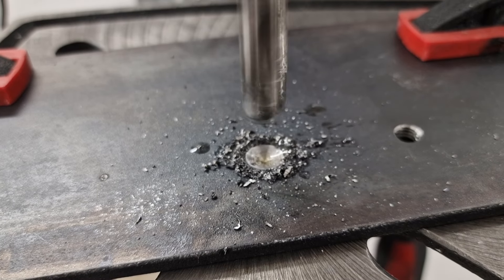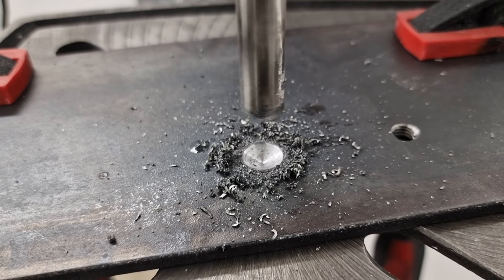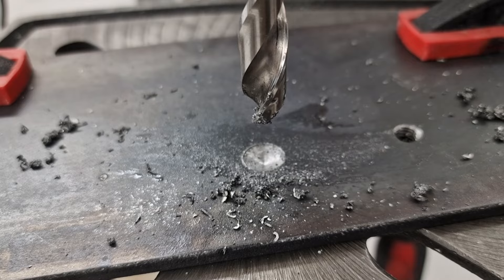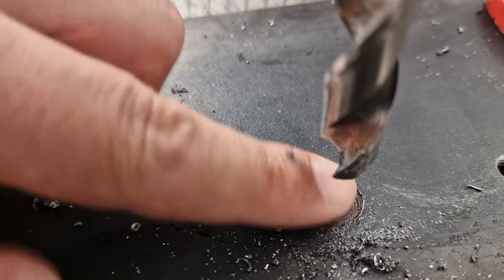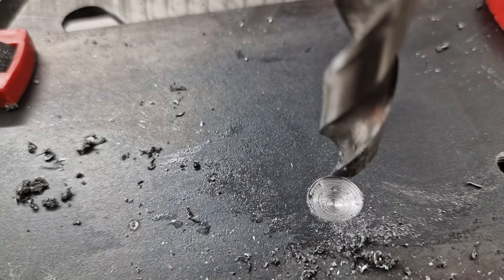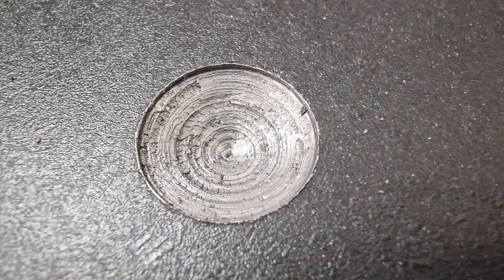Let's see that with a bit with damaged cutting edges, I have to apply a lot of pressure to cut the steel and the bit doesn't really do a great job. In fact, the bit scrapes and overheats the material to a point where it becomes useless to go on. Imagine if you had to make 10 holes — it becomes impossible.